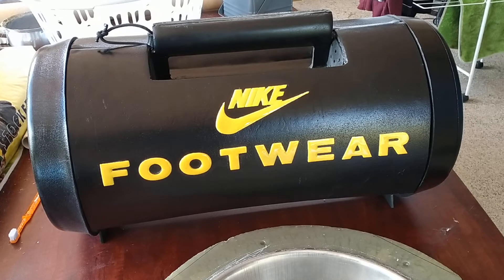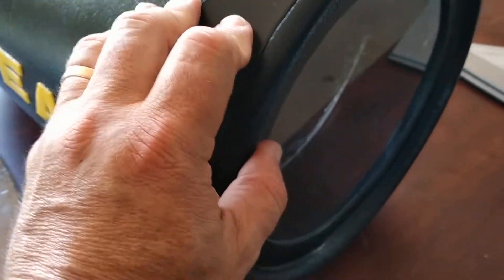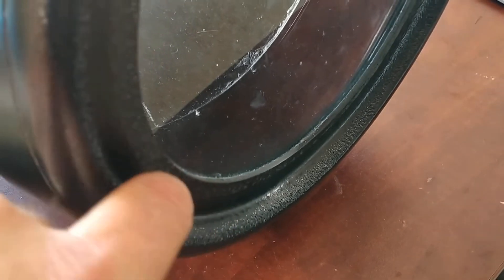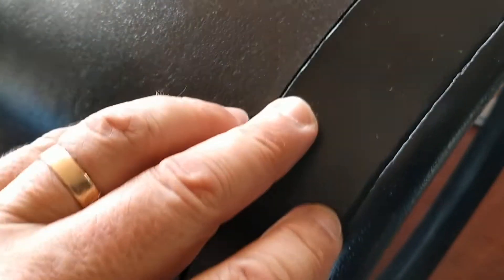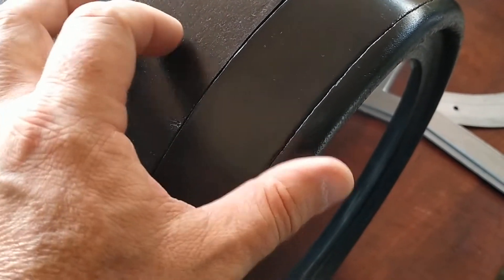This tube bag was actually made on positive tooling, and what I'll show you is the parts that I'm not happy with. To get this recess done properly, I really had to heat the plastic up to the point where, if I zoom in, it's actually kind of melted it a bit to get a really tight pull there. You can see the split — it just wouldn't pull down over that distance. The tool was about an inch and a half, and the tool was two inches deep, and I had to trim it because it basically flared out and didn't pull down tight.